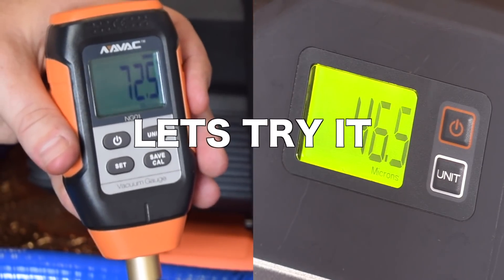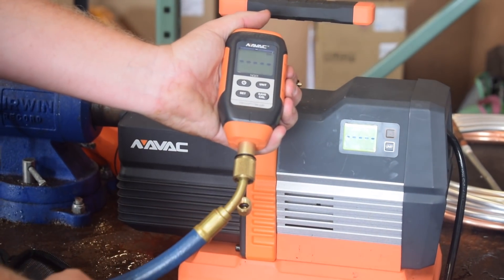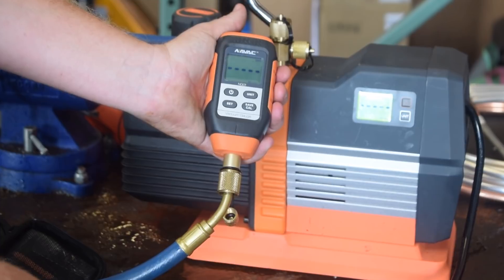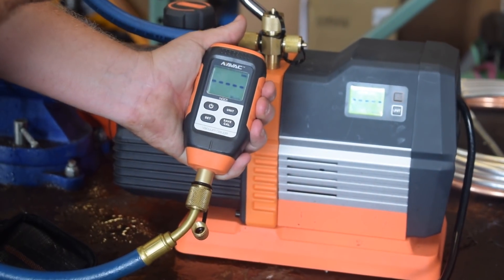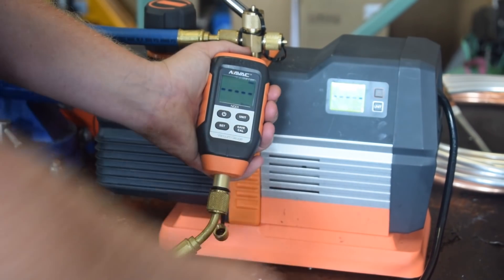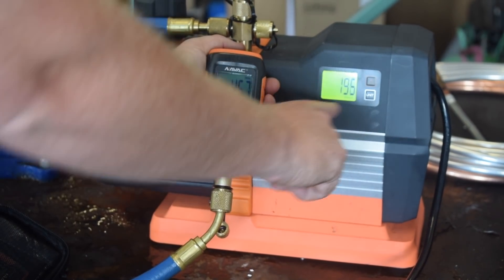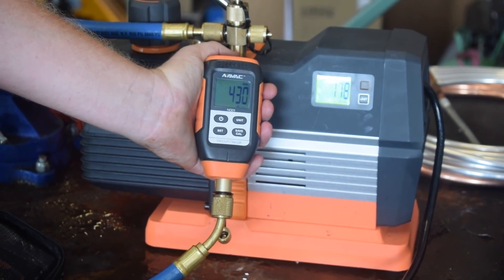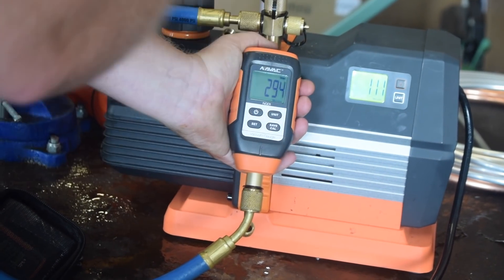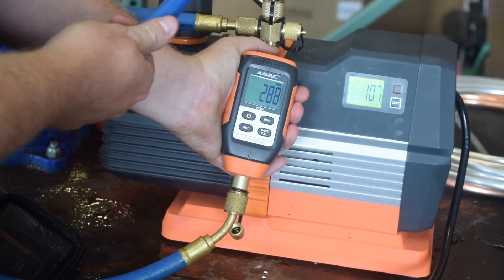Now that I'm thinking about it, let's try it and see what we get. I'm actually using high-flow vacuum-rated hoses here — these aren't even typical quarter inch hoses — and we're going to see if we get a difference in pressure drop between what we saw with the very large diameter Trueblue and what we see with these still very high quality but lower internal capacity vacuum-rated hoses. You can already see we have a much larger difference between these two than what we had previously. It's not coming down as quickly and there is a greater differential, a greater pressure drop across the rig — and we don't have any Schraders in place. This is a high-rated vacuum-rated hose.